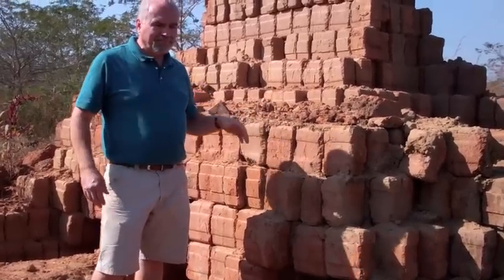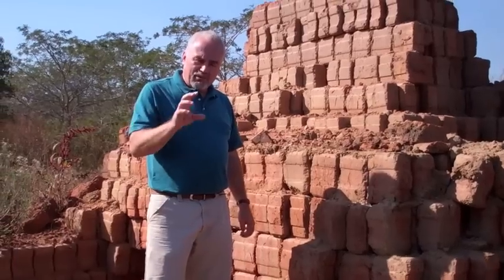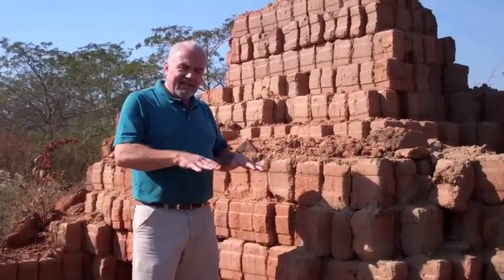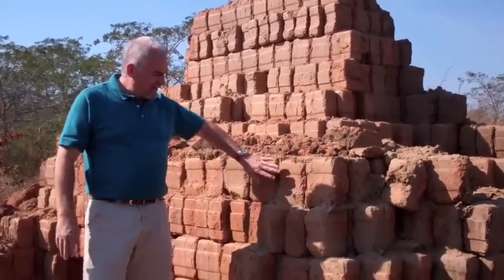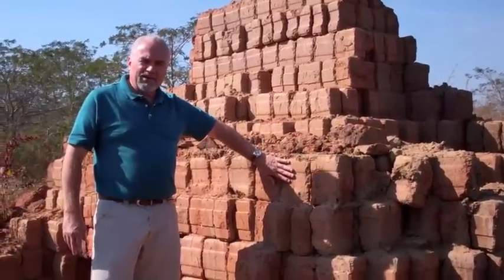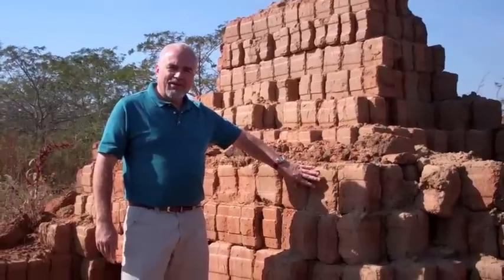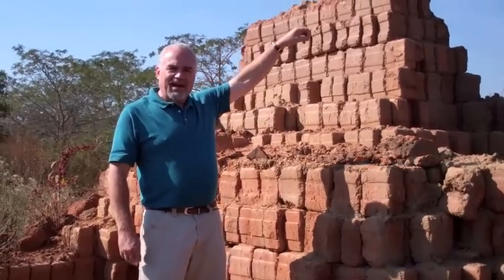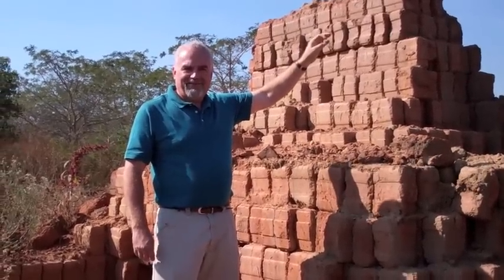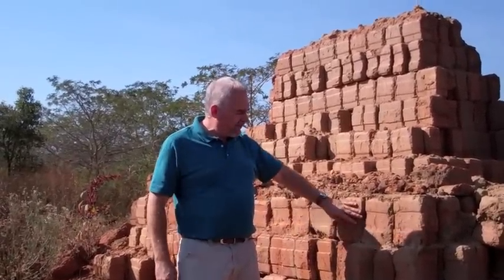They'll pack the entire thing with mud — you can see the mud on top here. They'll pull a block out and light the fire. Once this thing gets hot, and it takes about three to five days to burn a kiln, these become very, very strong. The blocks have got to be dry when they go in. The way we know they're hot enough is when we throw grass on the top and it ignites immediately. We always lose about ten percent of the blocks because they don't burn properly — we'll probably burn those again in another fire.